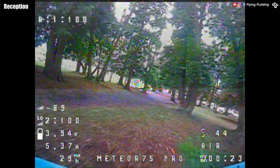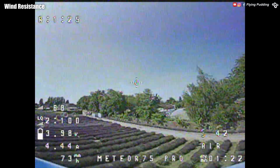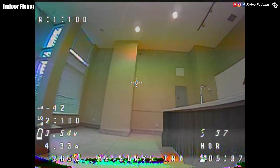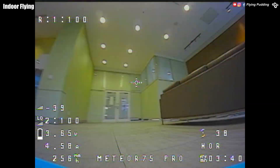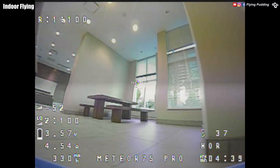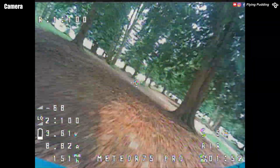I tried cranking up the VTX power to 400 milliwatt with similar results, though it is still possible to fly around trees as long as I stay low. At about 44 grams with a 551S pack, it has no issue handling moderate breeze at higher altitude. Not as nimble as a 65 Whoop, but it makes up with much better power and flight time. Still perfectly capable of clearing small gaps even under the couch. Pretty surprised by the dynamic range of the CO3 camera — the surroundings are still viewable even when pointing at the sun directly.